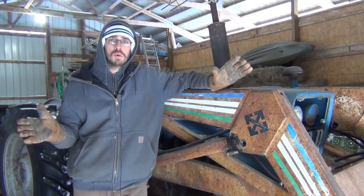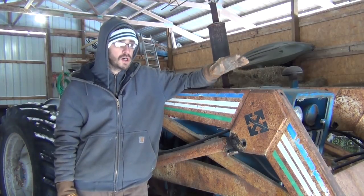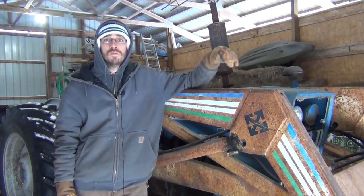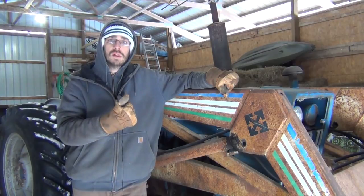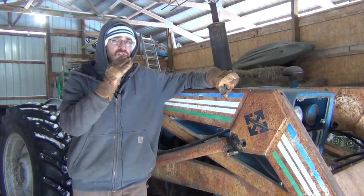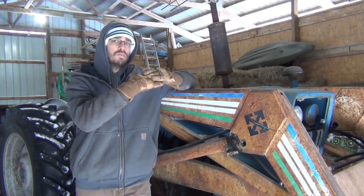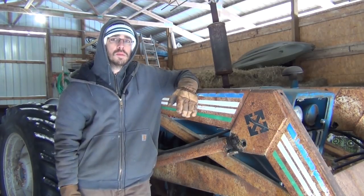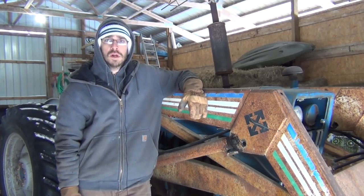Today it's below zero out. With wind chill, it's like negative 15. It's very cold. It's really hard starting older equipment like this when it's this cold out. The nice thing about this tractor is it has a block warmer in it. So I plug it in and put that little adapter in there that you saw at the beginning, and that warms the engine. As far as I know, it actually heats the block and the coolant, and that coolant starts to circulate in there. If you let it heat up for a couple hours, the engine's practically like it's been running, and it just fires right up usually for me.